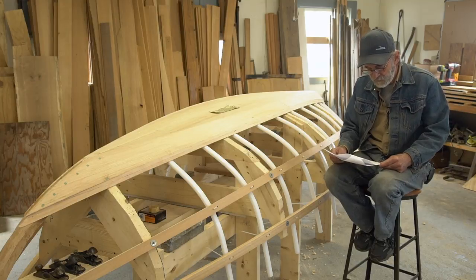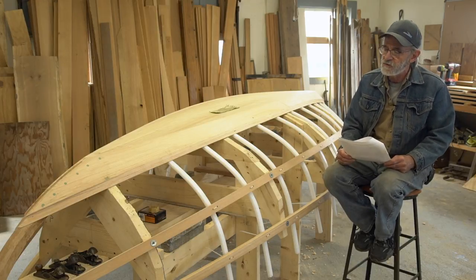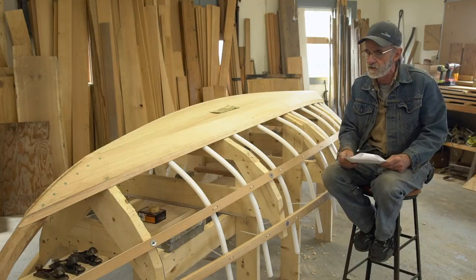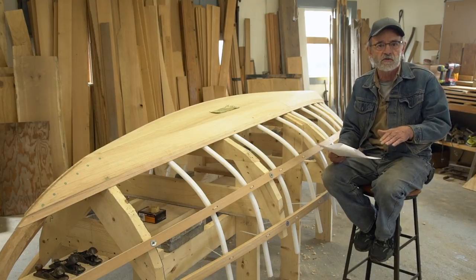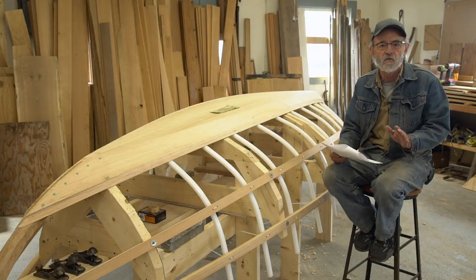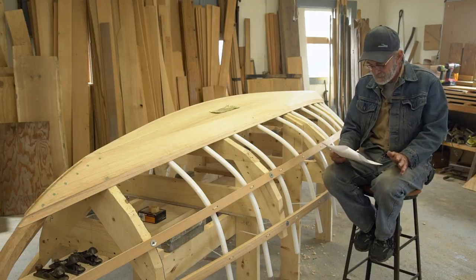Our next question here is from Mr. Welcher. Hi, good job and pleasure to watch. I've noticed that you are in possession of several block planes, and they seem to be very handy in day-to-day operation. I'd love to hear your opinion on different models. Which one do you like the most, and how do you set them up for specific kinds of tasks? Take care. Well, yes, I have quite a few block planes on this particular job, because the curvatures on the boat don't require you to have a long plane like a number 5 plane or anything like that. And after having used block planes my whole life, I've determined that I kind of like the high angle block planes much more than the low angle block planes. There's no particular block plane or particular model that I really need or want. I can pick up almost any block plane that's high angle and get the same use out of it. But the thing has got to be sharp.